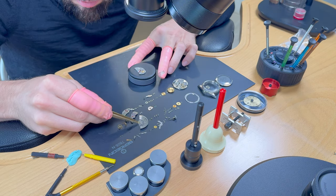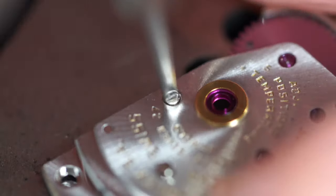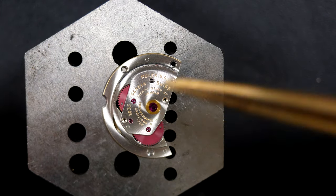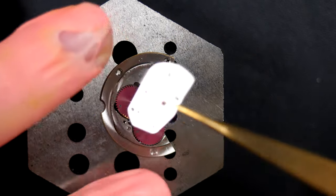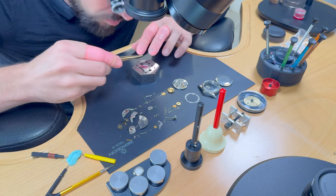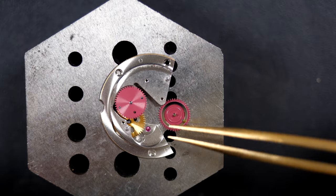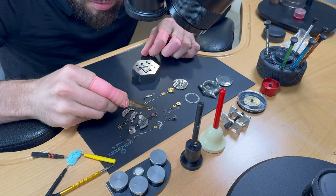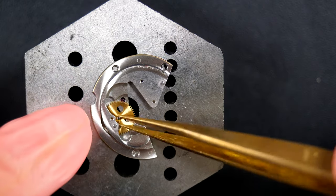We have the big rotor here. Disassembling the rest of the parts — it's pretty simple on a Rolex. The winding mechanism has no complex springs and not many wheels. We can see the caliber number 3035 on top. We have two reversing wheels — these are the parts that allow the watch to wind in both directions as the rotor turns. Very simple but very efficient, as always with Rolex mechanisms.